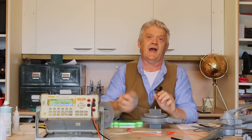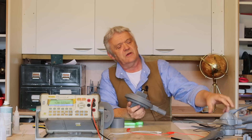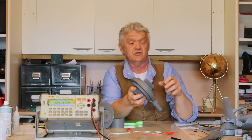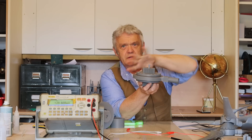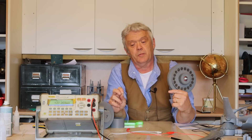Although we did this version as a hand crank generator, it should be pretty obvious you could attach this to a bike, to other gearing systems, or to a water wheel — there's a whole range of things you could attach it to. Of course we want it for our dual wind turbine arrangement, with one generator on each side. Equally you could do contra-rotation, or sit it vertically and put a Savonius rotor on top for a vertical wind turbine. It's a very adaptable, easy-to-build generator that's relatively cheap and performs quite well. The wire is 0.2mm diameter enamel copper wire and there are 500 turns on the serpentine coil. I hope you enjoyed the video — thank you very much for watching, and please do remember to like and subscribe.